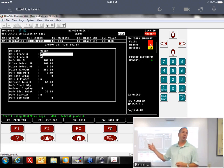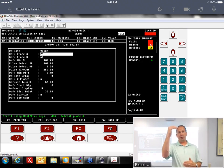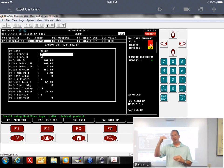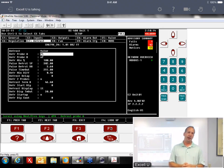So your defrost duration was 60 minutes. They said minimum defrost time 45 minutes. And so what would happen then was it would reach that termination temp and it would shut off. Then once that temp dropped, it would re-engage the heater again, because it's saying I have not met my minimum defrost time yet. So I reached that termination point, I shut off, and then once the temperature drops below, I still haven't met my minimum defrost time, so I go back in. So it looks like a pulse defrost. It's in and out of defrost. Again, it was all because the probe was in the wrong place.